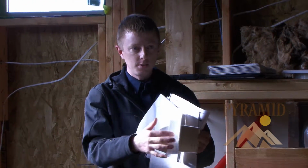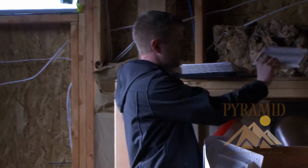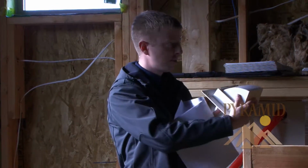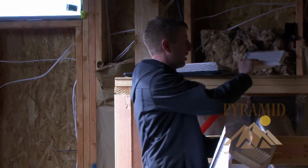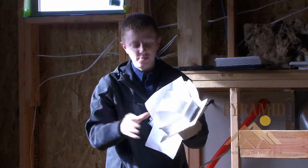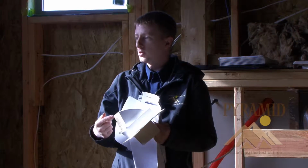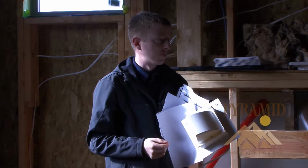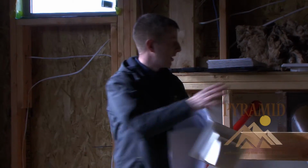This is a two-piece system, so it has a damper in there. Here's the damper. Same as these dampers. But it keeps air from backdrafting back through your fan. Has a little cage to keep critters out. Robins are really good at opening these up. They're not as good at coming back out. Okay, so we can fish them out, but it's not good for anybody, including the robin. This one has a screen. Now the dryer vents don't, so they come in screenless. But the flashing is 360 degrees around the perimeter. So when this is sealed, which we can see some on the side of the house, it's a much better fitting than what this is.